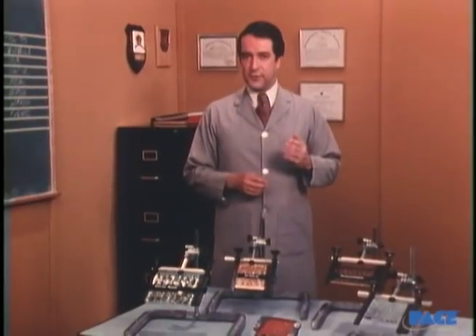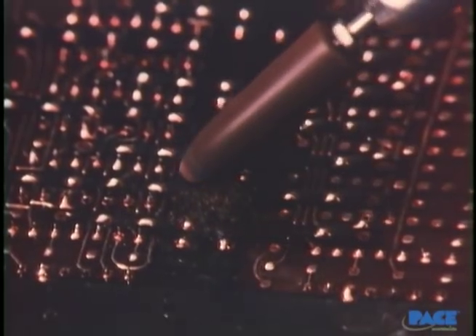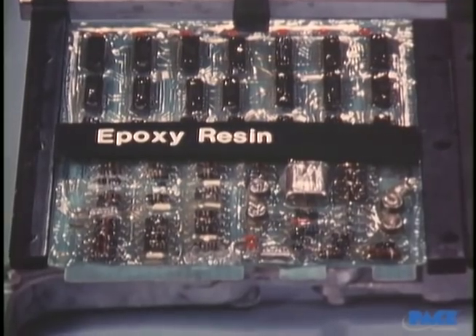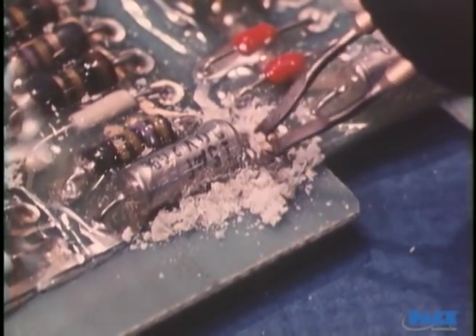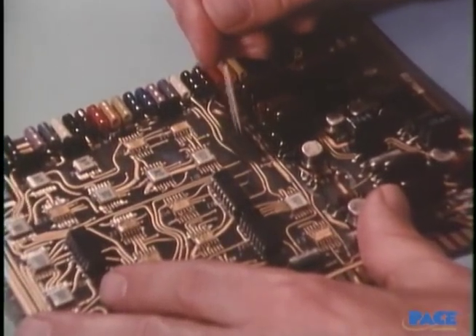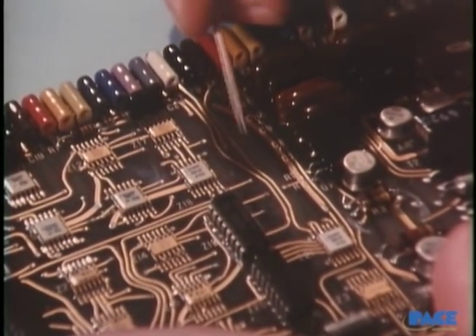Let's take thickness first. We can abrade away a thin coating much more quickly and easily than a thick one. The epoxy resin on this one is one-eighth inch thick, so we'll need a two-step approach: one technique to rapidly thin it down to where we're close to the board surface, and then a second, more precisely controlled method to remove the remainder without damaging the board. After thickness, we determine how hard it is. We can take a pointed object and try pushing it into the coated surface — is it hard, soft, in between? This tells us what type of abrasive to select.